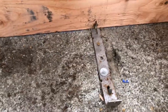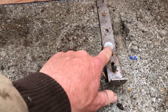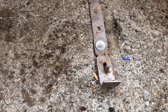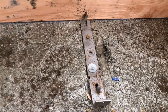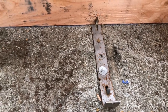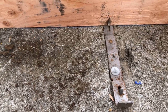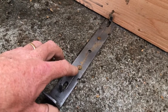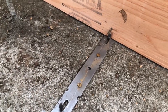And so we waited another day, and here's one of the powder actuated nails, and you can see it bent the clip again and sunk in. And I think I could have pulled that one out as well. One thing that I learned when I first started working construction in high school was that if the concrete is green enough, you can actually drive regular 16-penny framing nails into the concrete to hold your forms for your wall.